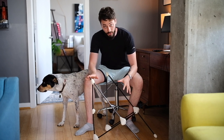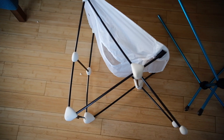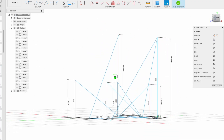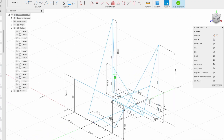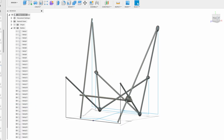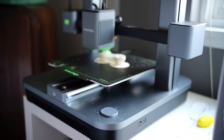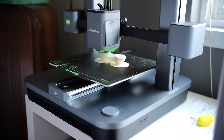I'm going to redesign it using slightly thinner carbon, slightly smaller hubs, and a less idiotic angle for the front legs. For version 2, I don't just wing the geometry — I actually constrain it all to a 3D sketch the way I should have done it in the first place. In addition to the steeper front leg angle, I also added rear cross members to keep the thing from wobbling left and right.